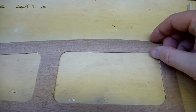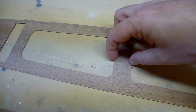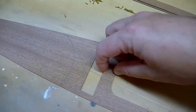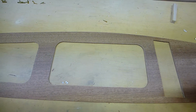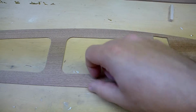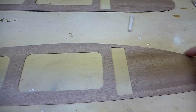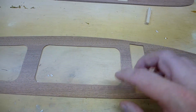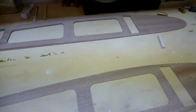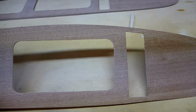And I just kind of drew these by hand. I think I've got about 3/4 of an inch material here, about an inch here, and what's that? Maybe 3/4 of an inch there and here. And then the outside, I would just take that to the oscillating belt sander and eventually get rid of the pencil line that I had traced around it and just compare it with a completed rib that I had built in the jig. So I made 4 of these, got the outline just right by continuously comparing it with the regular rib until it was really close.